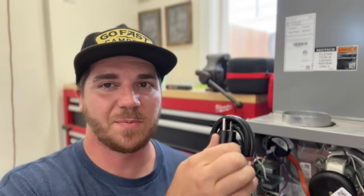I want to answer a couple of questions that come up often. Number one: will this pigtail ever be live? The answer is no. The other question: will this ever send power back or backfeed the grid, potentially harming a lineman? Also no — these are totally isolated. When we put this pigtail on, it's like a fridge, a toaster oven, a microwave, or a TV. It simply plugs into the outlet, and when you need emergency power, you unplug it and plug it into a generator, power station, or inverter. It's only a 15-amp circuit requiring a 14-gauge pigtail.